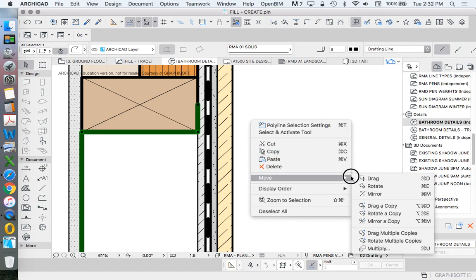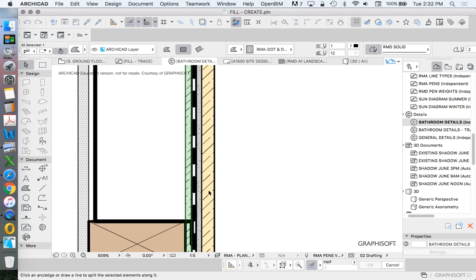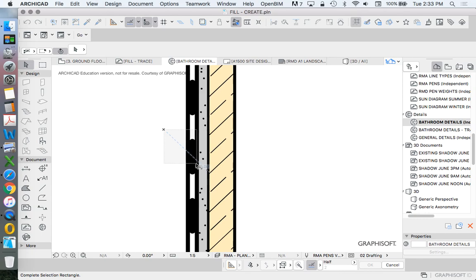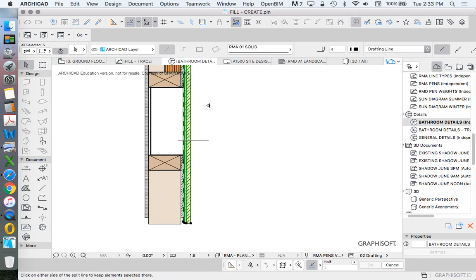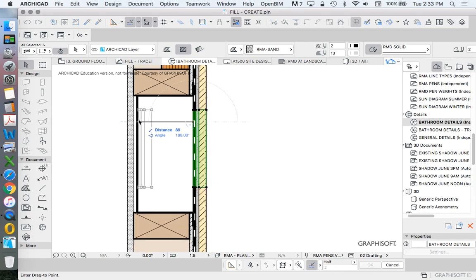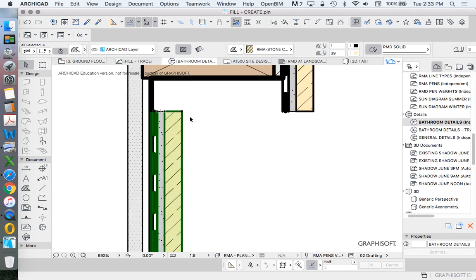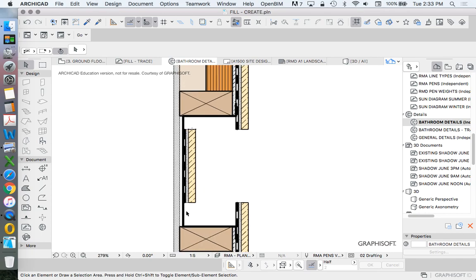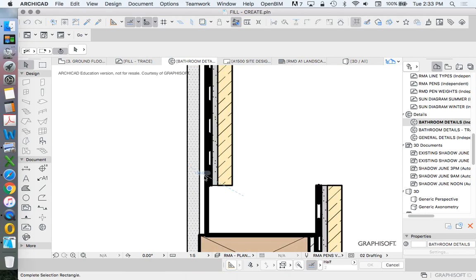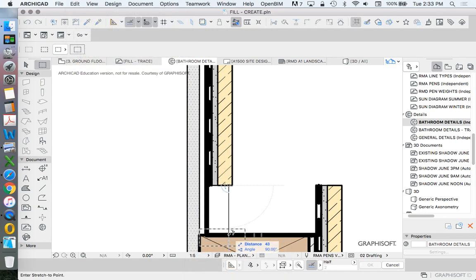Probably taking advantage of the sealed nature of the stainless steel edge would be smarter to put on the outside of the villa board. And then we could cut away the villa board. We want to waterproof around, so let's just trim all of these to make our life easy. And we'll move that to the back. I don't need to use waterproofing all the way around necessarily, but I will for now, just in case that was done with something other than stainless steel, which has a folded or a welded joint. When I get to the bottom, of course I'll stretch it. Do the same at the top.